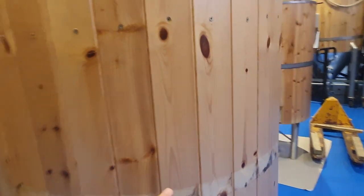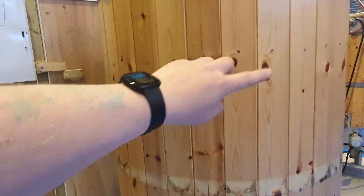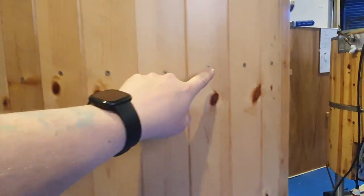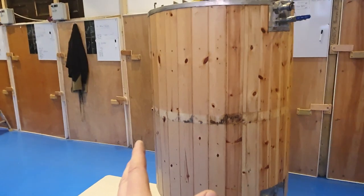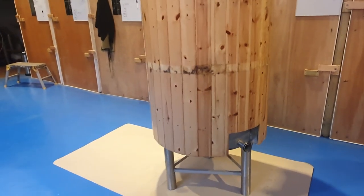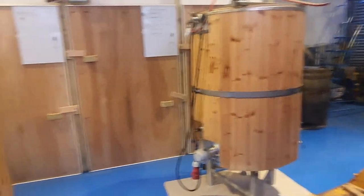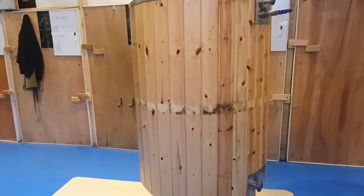These are little welded supports - same on here - they come up and jut out a little bit, and we put timbers on there running from top to bottom. Then around the circumference of the tank, each leg has a support timber, and around from one support timber to the next we go around again. These timbers are screwed on and held against gravity on the tank. Around them, we have hardboard making a loop, and that hardboard gives us a base to screw on this matchboarding. We add one piece of matchboard, then another, then another, going all the way around the tank, cutting out for outlets and inlets, until we have a fully clad tank. The HLT seemed well-sized; the boil kettle, not so much - we're going to have to do a little more work cutting it down.